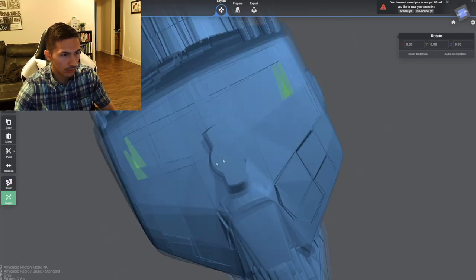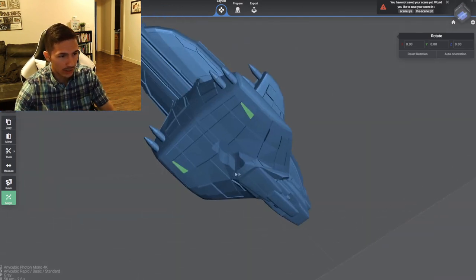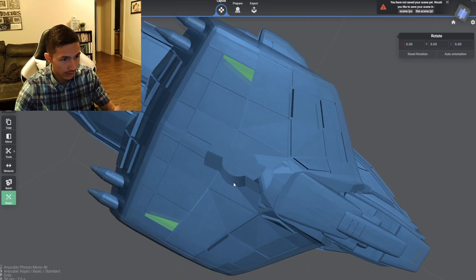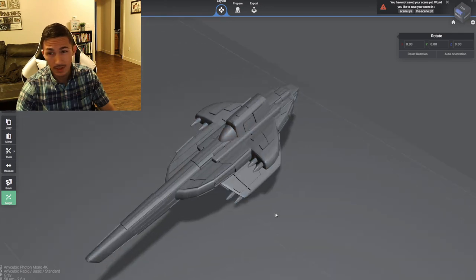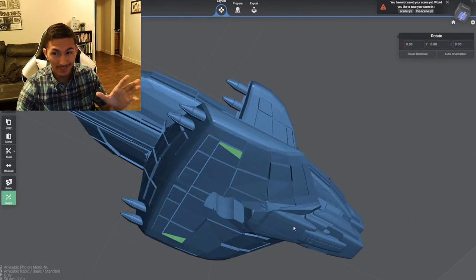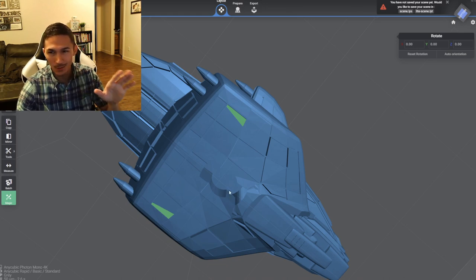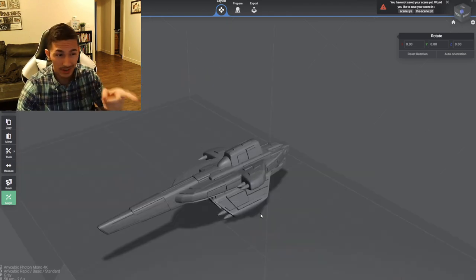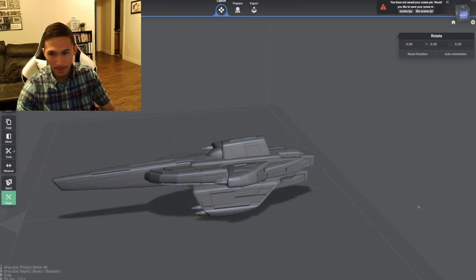You can see here we've got the twist lock rod hole, and it's a new mounting system that we designed. You print these rods that have this shape on the end. It goes into the hole, and then it twists 90 degrees to lock the model in place. People have really loved that system so far, and there are some important tips I want you to know when it comes to supporting holes like this. There are some things you might not usually think about that could cause problems later on when you're washing and curing. This one's actually going to be a bit easier, I think, than the organic model. That's at least my experience with hard surface models and supporting them.